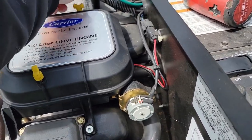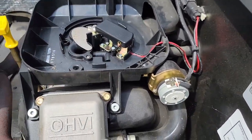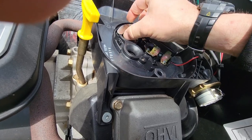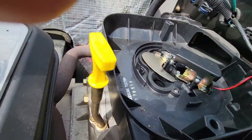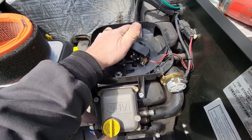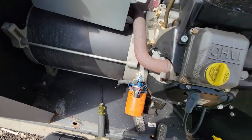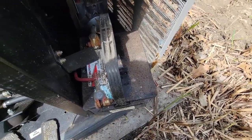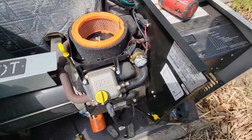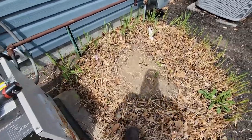If you're here watching because you want to try to avoid calling the Generac guy, I understand, but I'm not tech support. That right there is not a good idea - you want to keep that bent up just a little bit, just enough that you've got a gap. That has very little to do with what's going on today, possibly. They did say it didn't start, and although the battery looks about halfway decent, that's not the issue there either. Let's see what's going on with the fuel system - you've got to have fuel, spark, and compression in there and the thing should start and run.